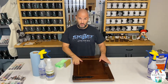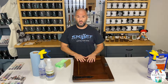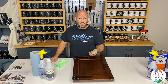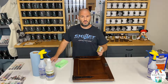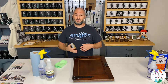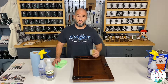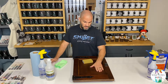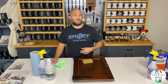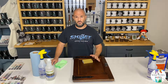We've let this thing dry completely — that's very important. Anytime you do anything with water or cleaning agent, let it dry before moving on. Our next step is to scuff. I have a 220 sanding block — you can use 320, but I wouldn't go any lower than 220 when scuffing. If you're new to furniture painting you might have heard you can just clean and paint — yes, you can — but this is our best practice recommendation. Scuffing gives the surface a little bit of teeth — something for the next steps to grip onto.